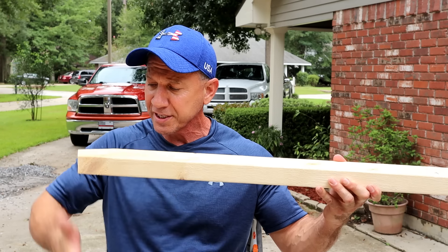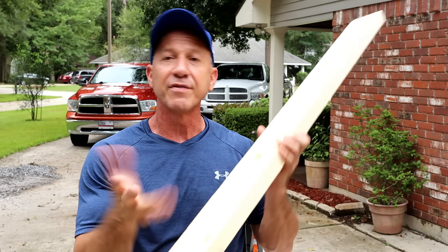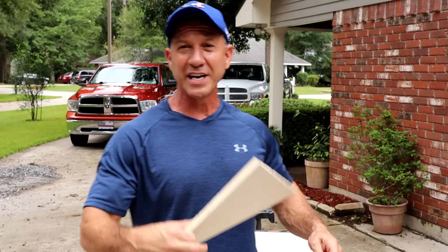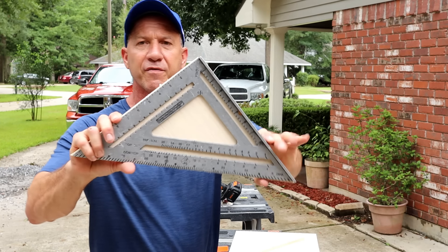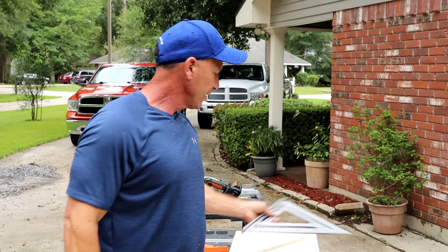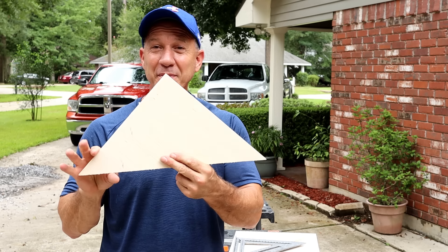Every one of them is going to be exact — it stops where you want it to stop. You get your 18 and a half degree cut on both ends and everything's going to be perfect. It does make it easier and faster. The only thing you'll have to do is make the back part of your bird's mouth when you cut that off. Here are my gusset plates — all I did was take a piece of plywood and cut triangles out of it. Once you make one it can be your template. I marked it off from my giant 12-inch speed square, set it on a piece of plywood, marked it off, and made my cut. Now every one of them is going to mimic this.